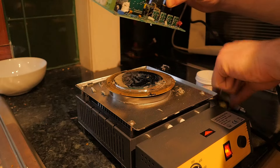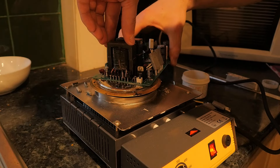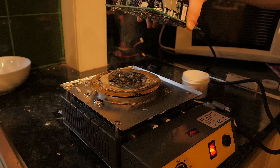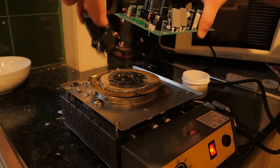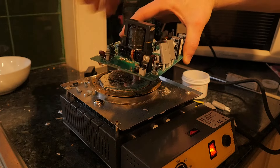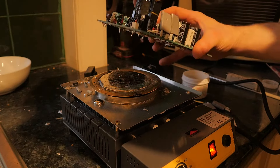Defeated pretty easily. I don't even know what that's for - gate drive or something, who knows. There are two large flyback transformers on the board, let's see how we get on with those. Now these, if you heat them up nicely, you can actually soften the varnish and pull them apart. I intend to rewind some of these and make a sort of isolated DC to DC converter, so I can run 12V stuff off the 48V battery bank I've got which can also go up to 60V. At 60V you can definitely feel it or even be killed in the worst case, so I prefer that to be isolated.